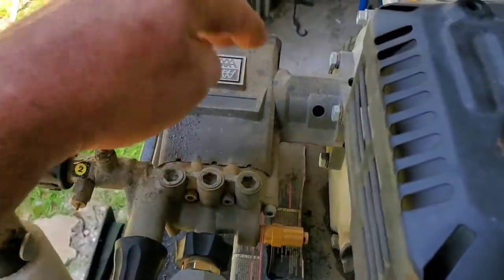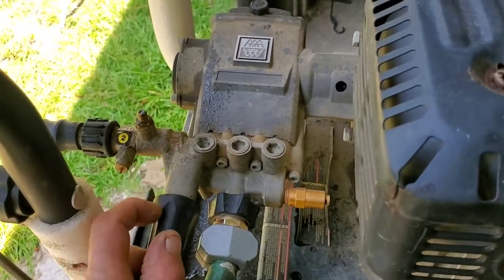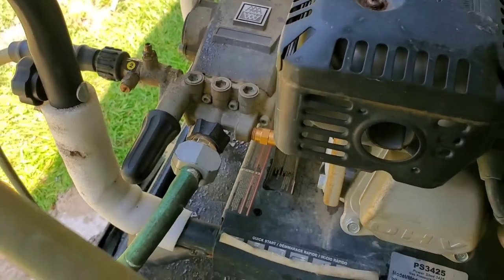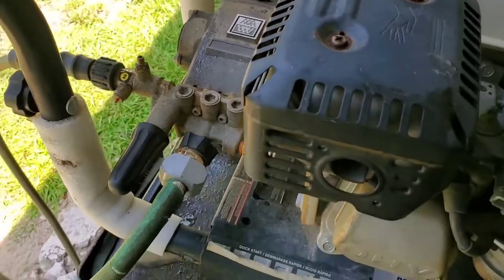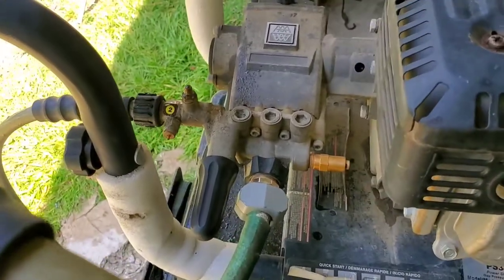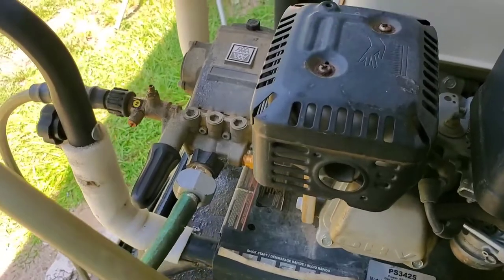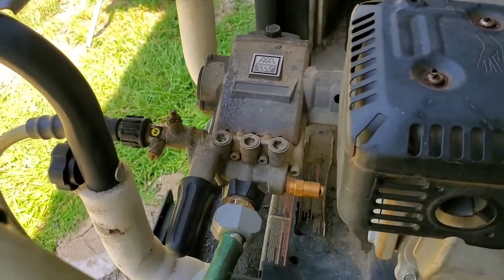The unloader — some of them are in different spots on these pumps. Take them out, clean them out, blow them out, be sure your little piston in there works and you should be good to go — hopefully, unless your pump's messed up. Thanks for watching the channel. Click that subscribe button, give us a thumbs up, leave a comment. Have a great day — Rayleigh's Small Engines, see you next time.